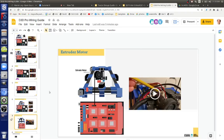Watch the videos. Extruder motor. That's a four-wire plug, the multicolor rainbow thing. That's the extruder, the upper left one. You may have to change the wire configuration. The wires should feed through so that they do not cross, and the other end of the wire should be in the same color order. If it's crossed, we take a little pin, remove the pins and switch them on the black side. The black side is easier to disconnect than the white, although you can disconnect both. So make the switch on the black side.